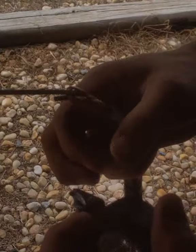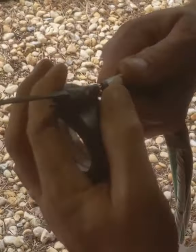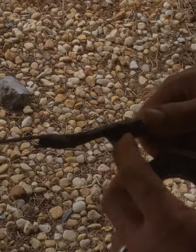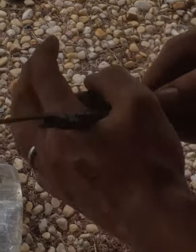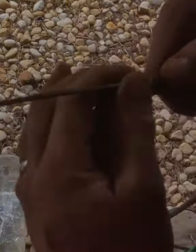I'm going to teach you a taping method called the half-lap. You start right here and lap half the way each pass — so you lap half of the tape over the last half, and so on. On a tough pull you can work your way back up as well. There are lots of different ways to layer the wire to make it even stronger and more effective. Pull the tape tight, then tape that sharp end and wrap back.